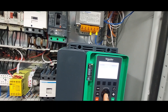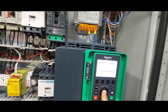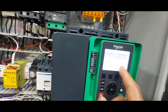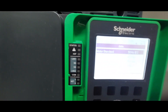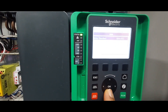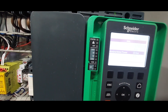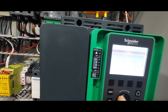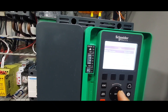In the motor data section you can enter the characteristics of the motor. I've put in 22 kilowatts here — you can select that. For maximum frequency I'm going to set it to 50 hertz.